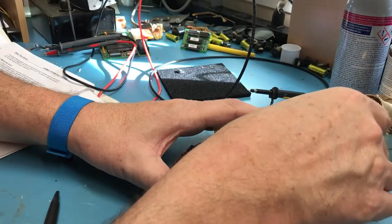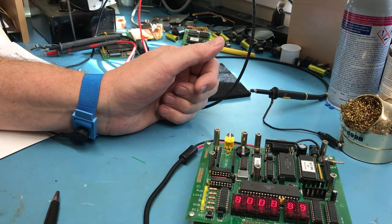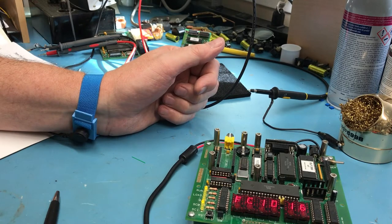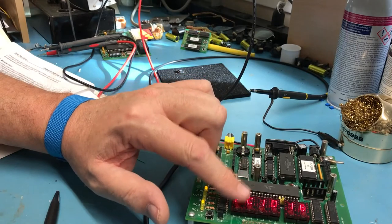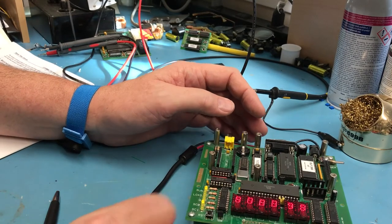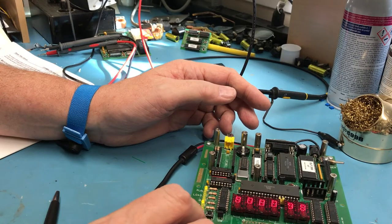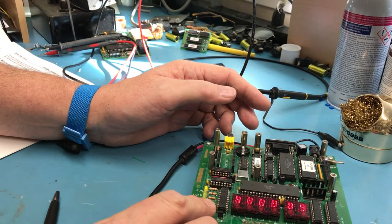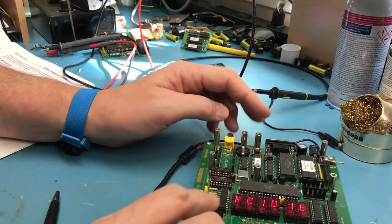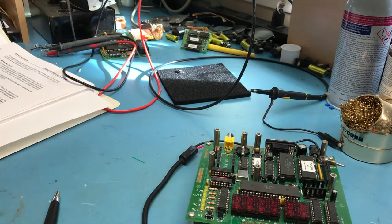I didn't actually look at the power draw. 610 milliamps, 580 when it gets to the halt. I'm going to call it a halt, I'm not sure. So 610 was the highest I saw, and right now it's idling at 610, it's very consistent. So it resets to 600, it gets to some point, does a jump to 610, and then 570, 580 when it goes into this quiet state. So I'm satisfied with this, that we have definite progress on seeing this little guy come back to life.